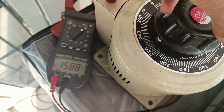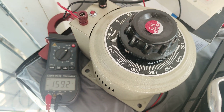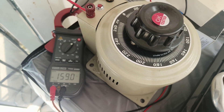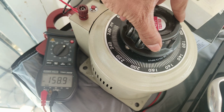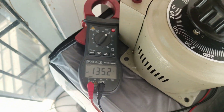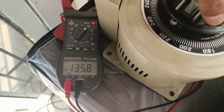Input voltage is 180, output is also 180. Input voltage is 160, output is also 160. Input voltage is 140, output is also 135. So it means the stabilizer is not working at all — the stabilizer output should be stable, but it is not stable actually.